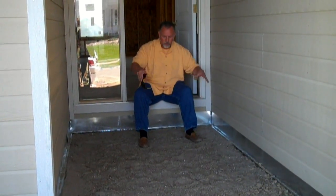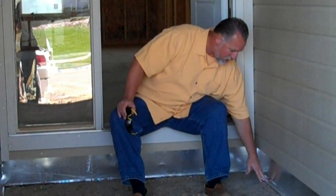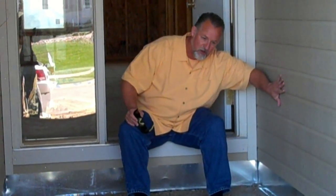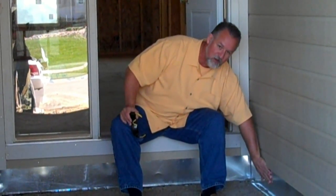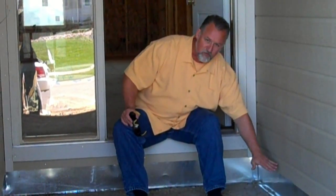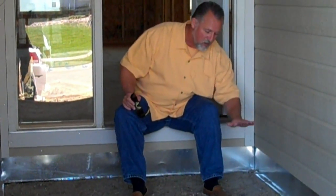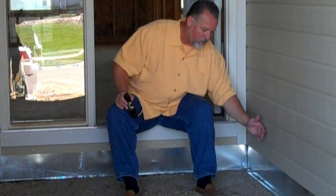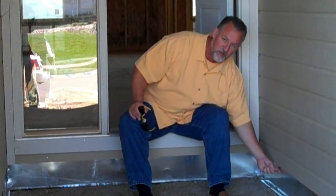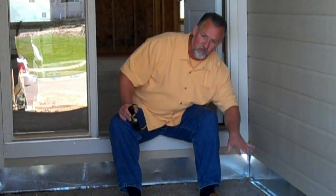This is the front porch area and in the front porch area we will put an L-shaped flashing here. It goes up underneath the siding so when the water comes down, it's going to come down here, it's going to hit this. The concrete will then be poured above this and so you're going to have the concrete sloped out to the street and the water will run out that way. If it should by chance get back behind here, then this flashing is here to protect it and what it will do is it will go into the sand which then goes into the dirt.